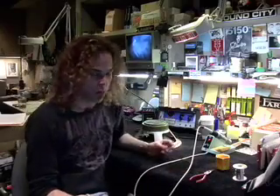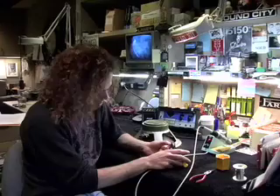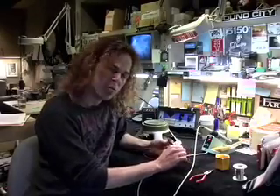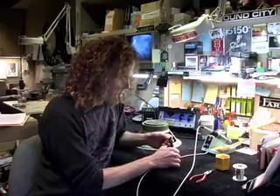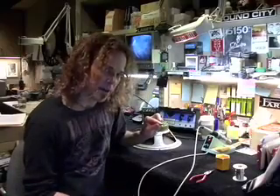The first thing you want to do is prep your wire. Take a clean wire with a clean cut and come back about a quarter inch to a half inch. In the needle section of the strippers you can see where it grips the wire — it doesn't cut it. Come around it a half inch back and don't clamp down hard. Clamp down gently, because all you want to do is strip the jacket off the wire. Then you turn the wire, press it again, turn it, press it again, and then pull the jacket off. Now you've got your wire exposed.